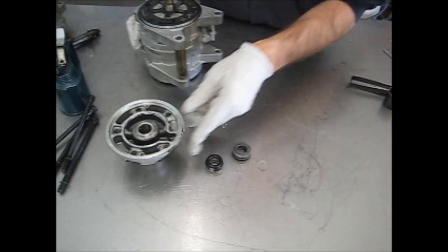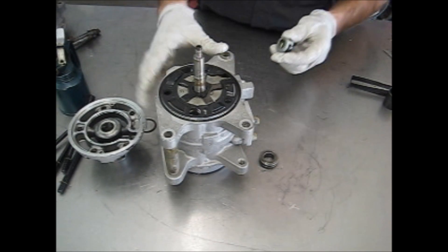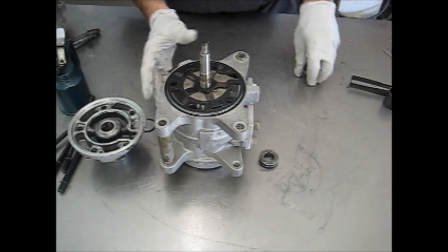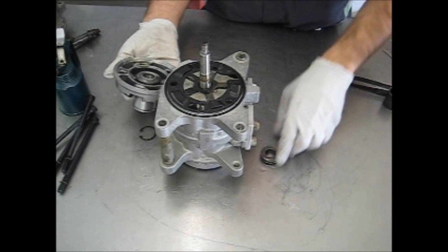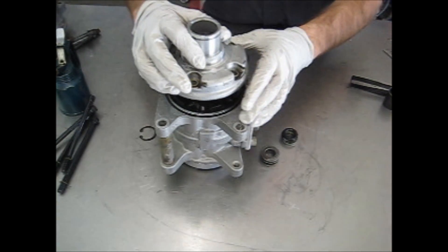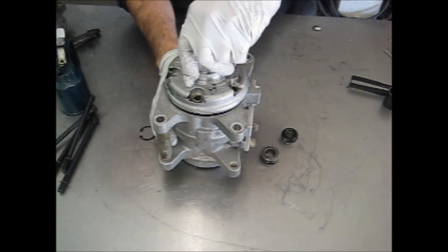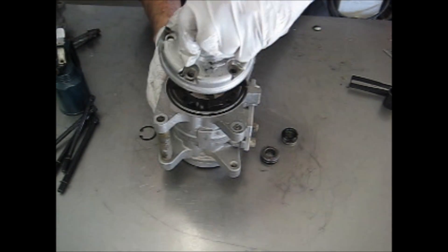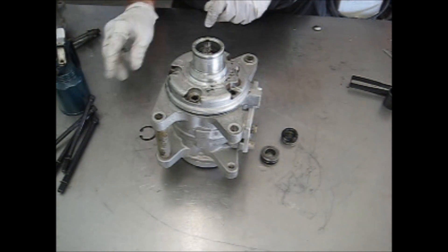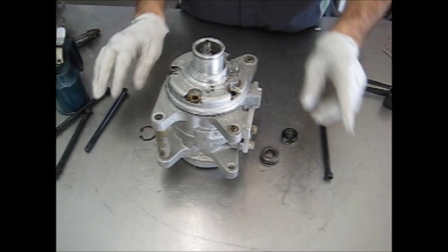To go back together: here are your tangs and the machined flat spots on the crankshaft — that's what you're trying to lock onto. After you replace the seals in the unit, we will not install a shaft seal until the very end. Go ahead and put the front cylinder head back on. There are dowel pins to line the whole thing up. Go ahead and install your through bolts and re-torque the unit.